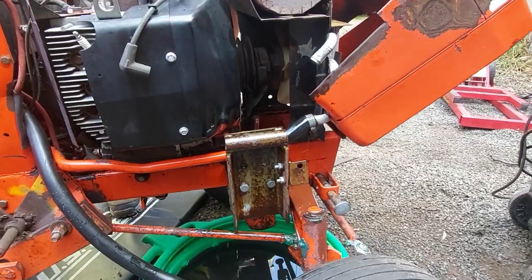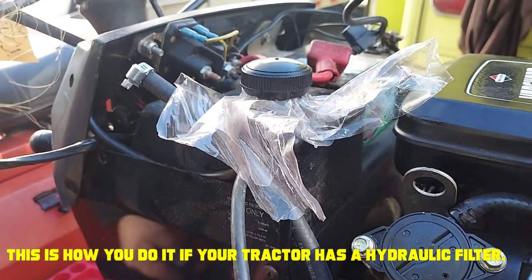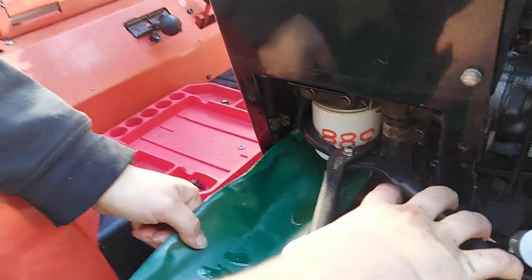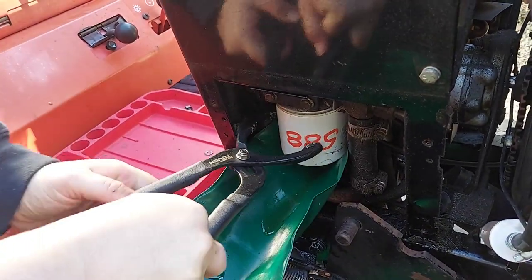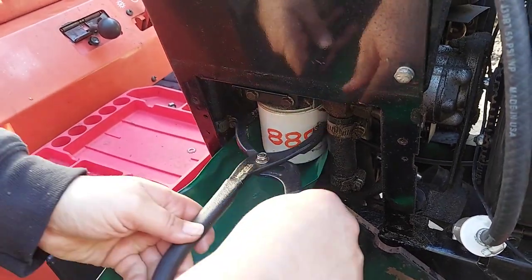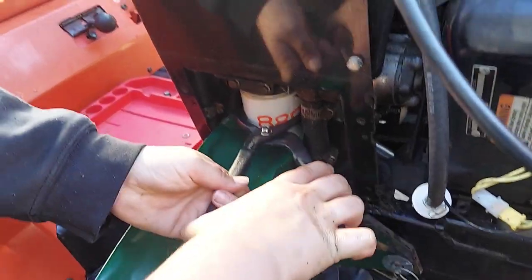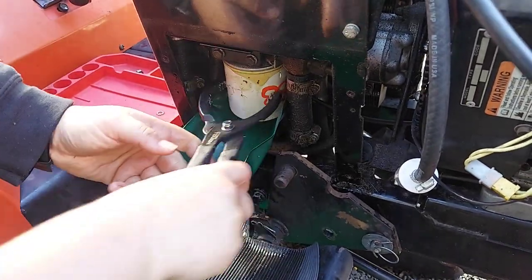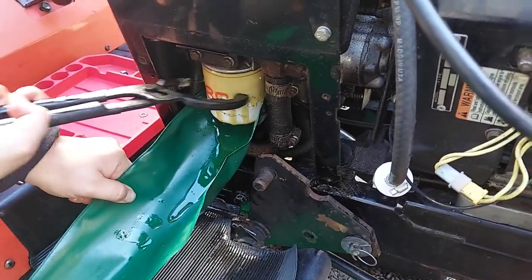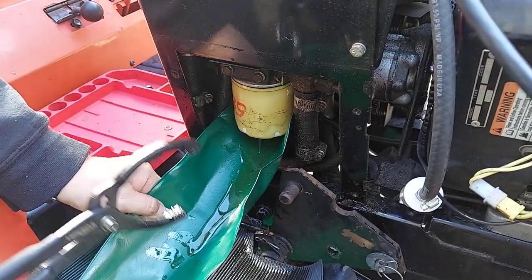Now we can put the new oil in. If you put a piece of plastic underneath your cap it usually helps lessen the mess and creates a vacuum in the tank, since your tank caps are vented. Use channel-lock style pliers or filter wrenches - these grab and bite good. We don't reuse filters ever, so it doesn't matter if the filter gets damaged. It should be just a bit more than hand-tight, so usually if somebody put it on correctly all you've got to do is turn it a half turn. Once it's spinning you can get on there with your hands and spin it up.